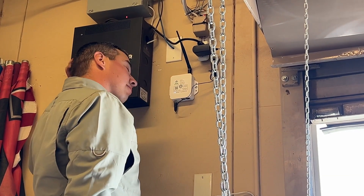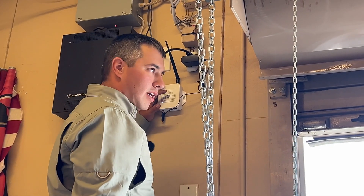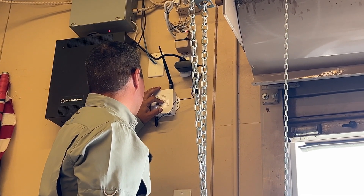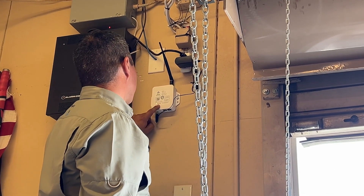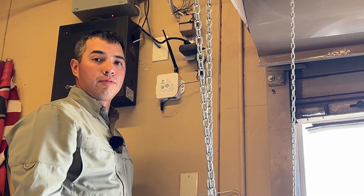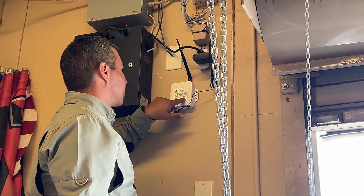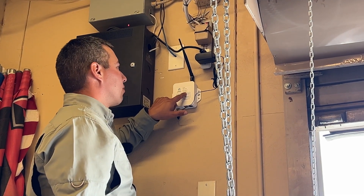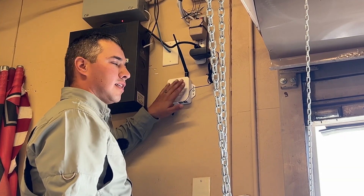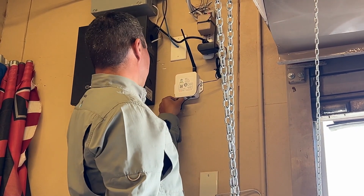We'll let it sit there for about two minutes, then hold this button for about one second and it'll start trying to look for the wifi. It should turn blue. Now we're able to go back to the customer — she can log into her account and look for this gateway. Your web address is right here and here's the gateway ID. You want to find that gateway ID so you know your internet is talking to this unit, and this unit is going to be looking for that sensor. It's saying we don't have any internet connection right now. You can also hook it up to ethernet — there are so many options with this device.